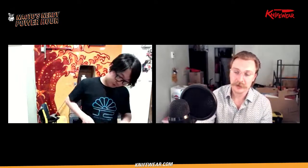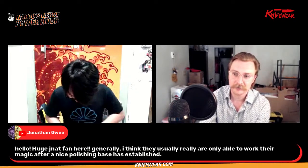Jonathan Gui says, hello, huge Japanese natural stone fan here. Generally, I think they are really only able to do their magic after a nice polishing base has been established. Do you agree or disagree? Yeah, that's definitely yes. You have to have the nice base established on the bevel, otherwise it's really hard to work on that. Generally speaking, natural stones are pretty fine, so you just have to make sure there are no previous deeper scratches left on the bevel. That makes sense, because it's not going to be able to remove those. Yeah, exactly.